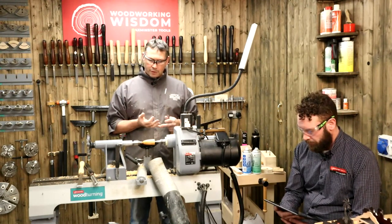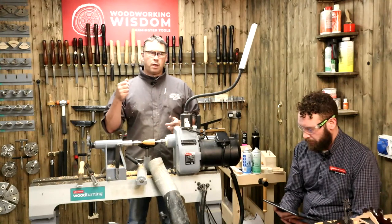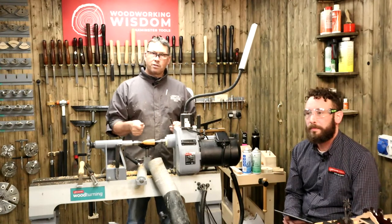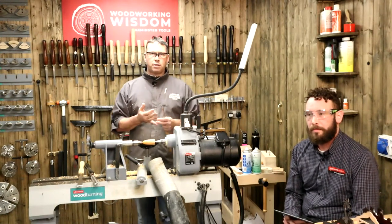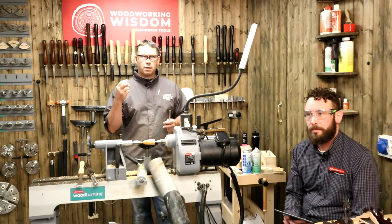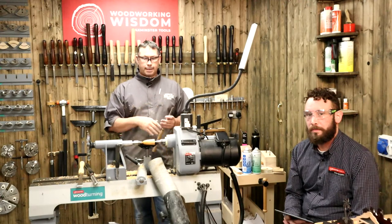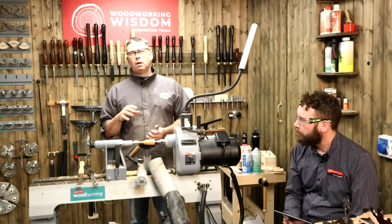Sanding sealer is for things like polish. So if you're using acrylic polish, French polish, polishing compounds, wax, all of those sorts of things, that's your sanding sealer. But spirit stains, palette dyes, and oils, don't use a sealer. We treat the timber in a slightly different way when you do that.